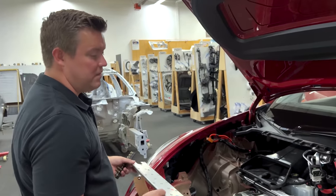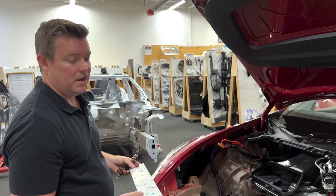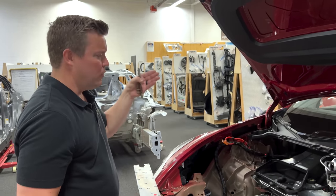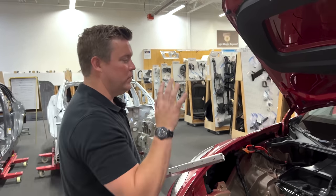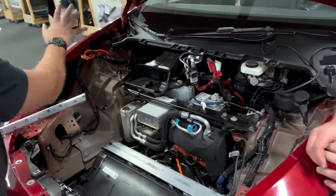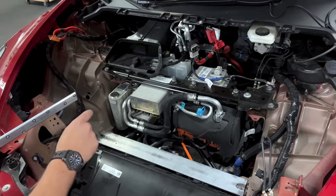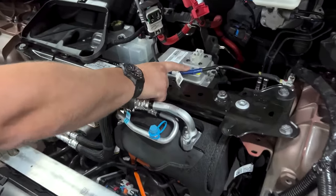Carl notes plastic fasteners range from three to fifteen cents depending on type. Anyway, it's in the cent range — but six of them eliminated from every vehicle is something no buyer would ever notice. This thirst for improvement is what we see: when we received that first Model 3 in late 2017, early 2018, we opened the hood and saw components that looked nothing like this. Even though the Model 3 and Model Y are on the same architecture, they had weldment shock towers and the super bottle — not the octo valve. They've since eliminated that with the heat pump system and even eliminated the lead acid battery, replacing it with a lithium ion one.